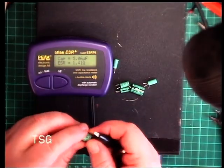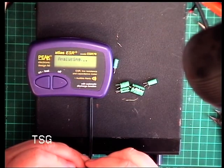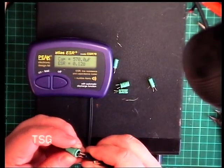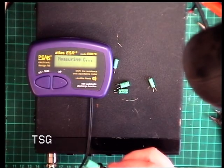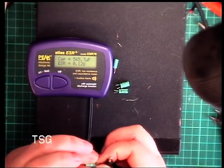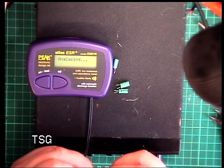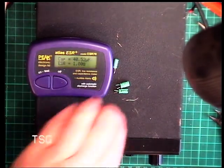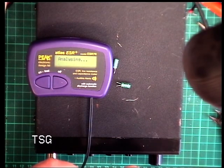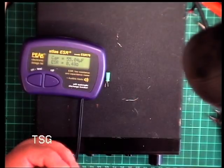2 out of the amplifier, 470 these should be. It's starting to fail. Another 470. Again, a bit high. 33, not one of our usual UK preferred values, but we have them in stock. 40, yeah, it's starting. This should be 47. That's fair enough. They're all going in the vertical filing cabinet.